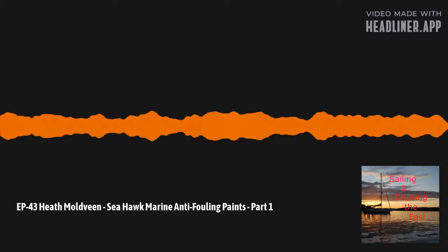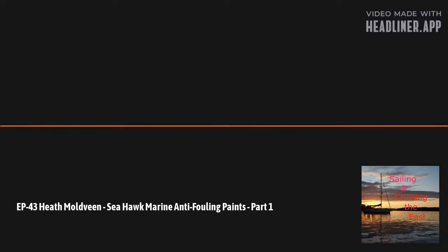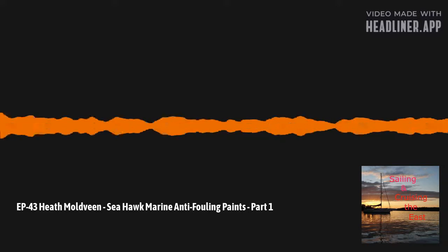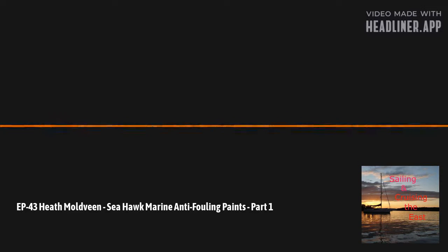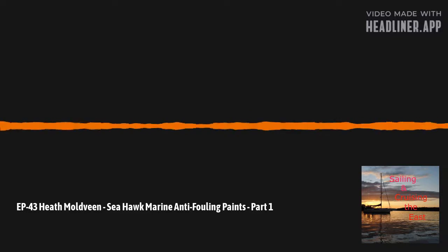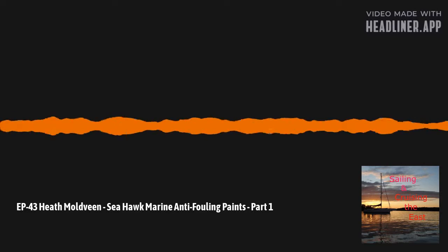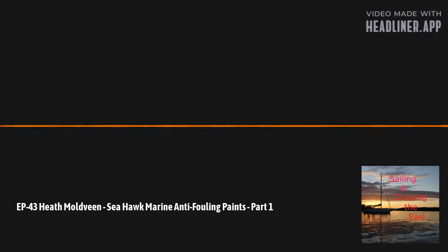Yeah. So is there a particular type of paint that if I'm a racer, I would want to use versus if I'm a cruiser? Sure. So within Seahawk, our paints can all, for the most part, be burnished. Burnishing being sanding with like 300 to 400, working your way up to, some people go as high as 1200 on the bottom of their boat, rubbing it with a diaper, you'd think, because they think they're going to go much faster. And you know what? In a one design fleet, that's vitally important.